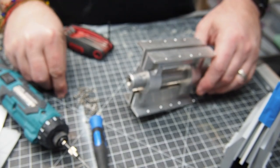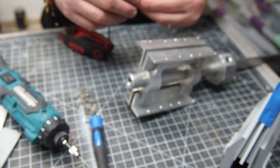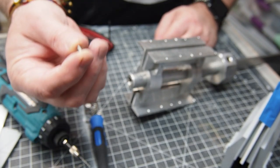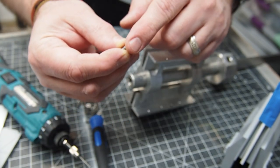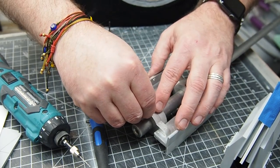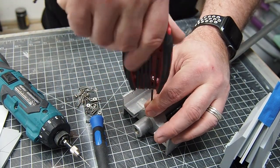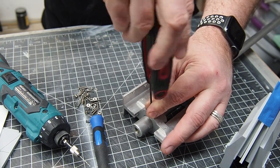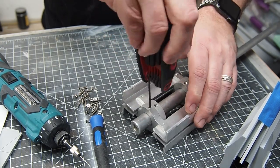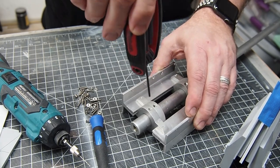First off, I have 4 little grub screws that, and apologies, my thumb doesn't bend the way it used to bend because of crazy osteoarthritis. Grub screws with little nylon tips. And those go in these 4 holes up top. And that is to use friction to set the resistance of the scissors. So these just clamp down onto the main bar and provide a little bit of real world resistance. So you just tighten them until you feel a little resistance and you can go from there.